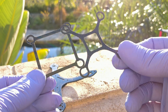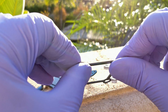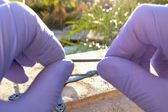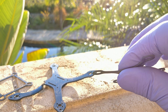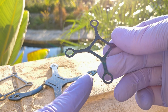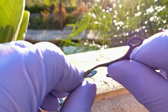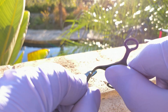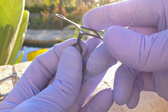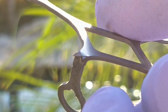These are tiny whoop braces, and even at one millimeter thin they exhibit the same effect. This is the linear carbon - if I flex it, it's nice and stiff. But this incorrectly cut one has the cross-hatching going down the sheet. Even though it's a shorter span - which should be harder to flex - look at that: I'm not putting any pressure on it and you can see it crack. You can clearly see the direction of the carbon fibers going down the arm.